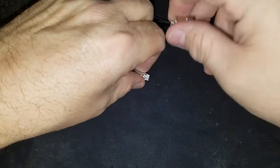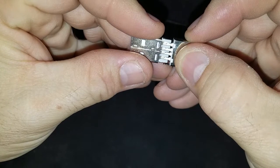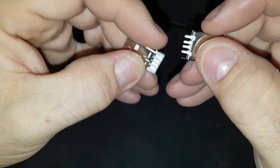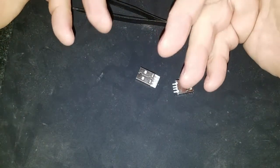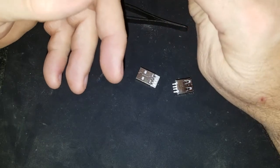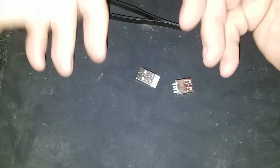Basically, you make sure the two center pins do not have continuity between the two. You don't want them to sync and transfer data. So you only want pin one and pin four — the red and the black. You can just easily take a cable, slice it gently, and pull out the red and black and leave them. The other two I think are green and yellow — you snip those two and it's just good.